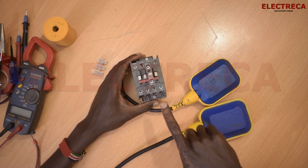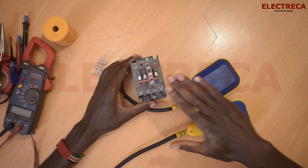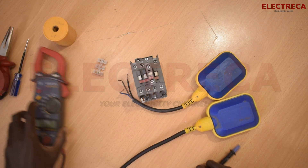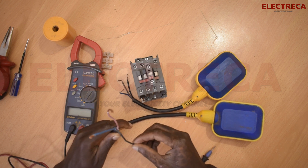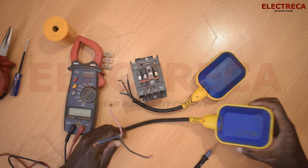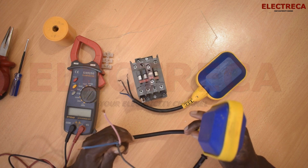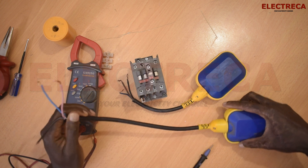You're going to need one contactor. You can decide if you need it with a push button or with a float switch only — we're just using float switch only. Now, this float switch has got three wires: one wire being common and the other two serve in two different positions. This float switch has two positions in its operation — it can be on or off.